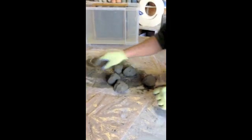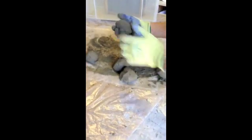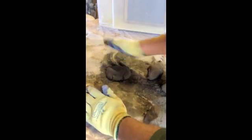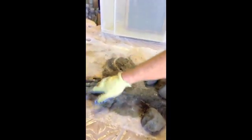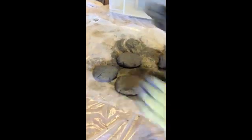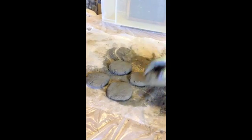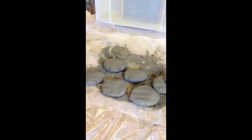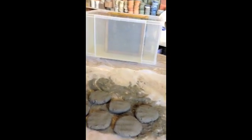It's a few minutes later and the material is beginning to gel quite strongly, and we can form it. If you can form it as much as you can on the surface to fit the void that you want to fill — just like that, little thick pancake sections like that — and just wait for it to gel. Then we can apply it to the concrete piece under water.